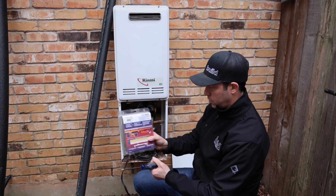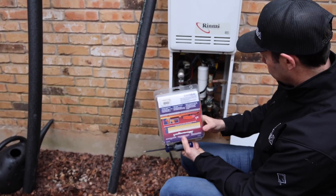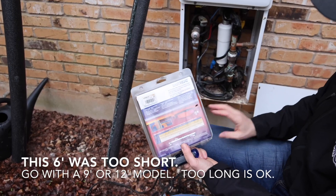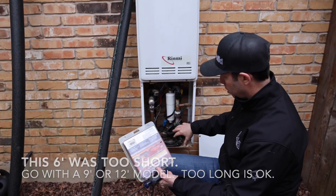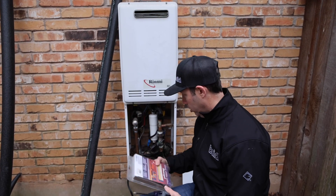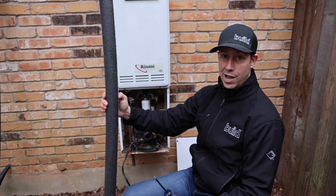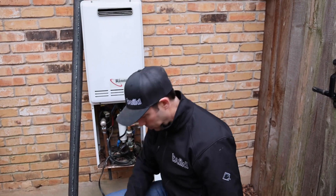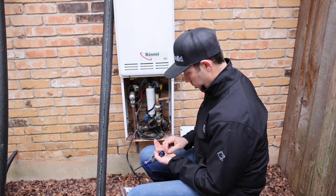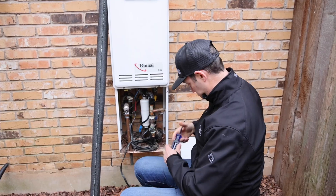I'll put a link in the description for this type of product — you can get it locally just about anywhere. I bought the six-foot version knowing that I've only got maybe two feet of pipe on each direction that needs to be protected. But if you had a bigger amount of visible pipe, you'd want to get the longer protection. We're going to wrap the pipes with this, then put some pipe insulation on top of that, and then we're basically just going to plug this heat tape in. Anytime it gets cold, it will run heat on here and keep this thing protected.